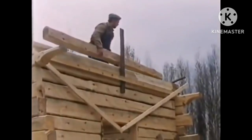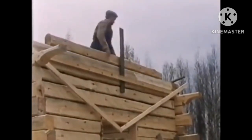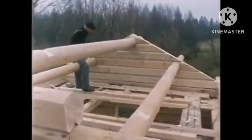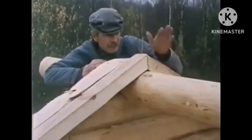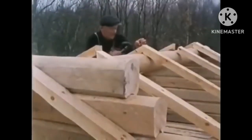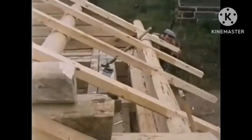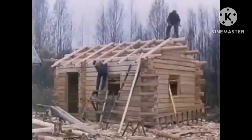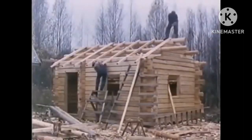Logs were then placed on both sides above the ceiling, and then the excess wood was cut off using a triangular frame. Three girders were then placed across both sides of the roof to sustain the roof. Beam-like roof trusses were supported by ridge beams, sidewalls, and two ceiling joists. Thinner supporting beams were placed sideways, and this is how the project should look at this stage.